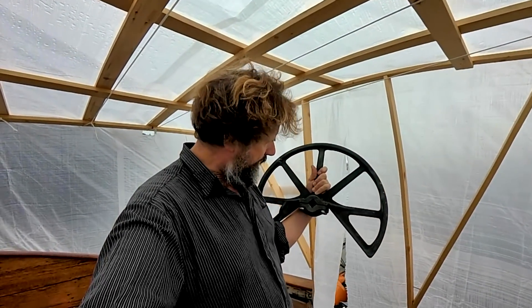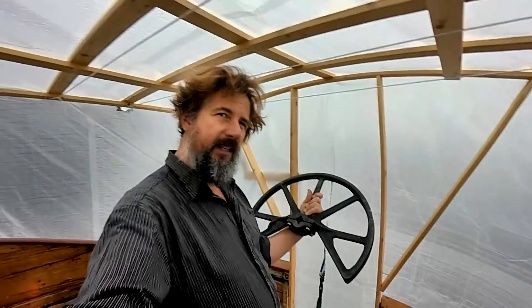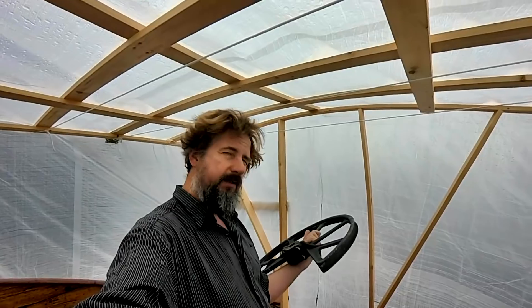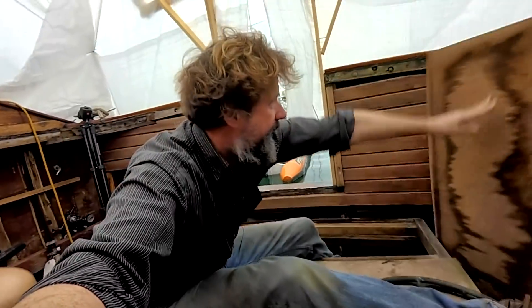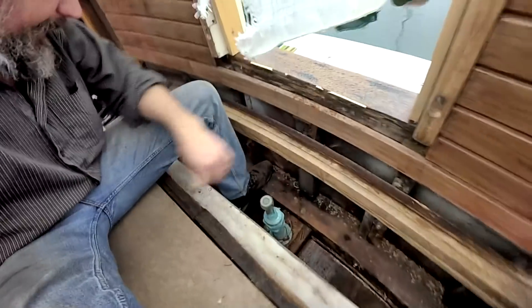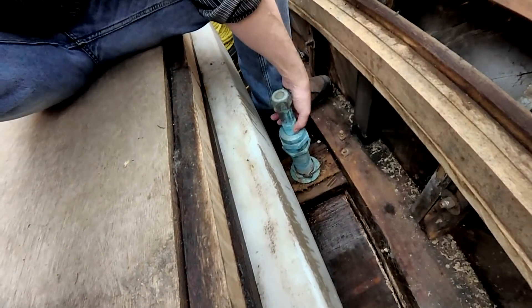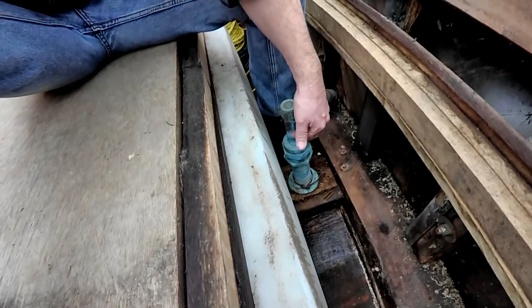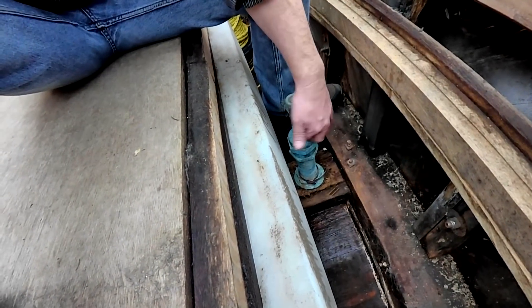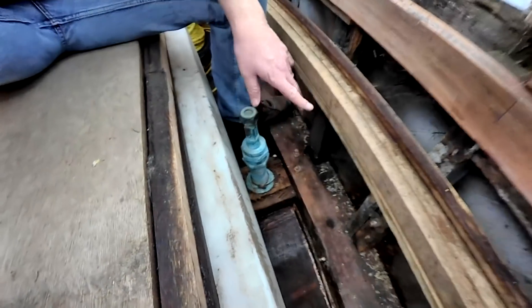The main reason this one is super valuable to me is that it has a square socket and clamp in the middle, and my rudder shaft is square. As well, the diameter will just barely fit with actually a little bit of trimming on some structure for the transom. If you peer down in here — here's the rudder stock, or rudder shaft — it's a square shaft, and a little further down it is round. It's one inch in diameter across the flats. I considered having this machined with a keyway so I could use a round one, but once I found a square one, I was thrilled.